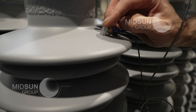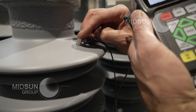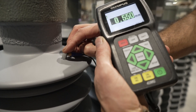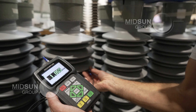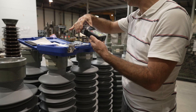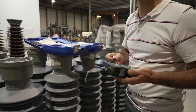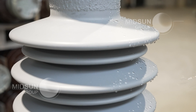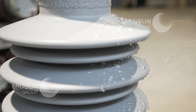For maximum protection and life expectancy, the coating should reach a thickness of 0.5 mm when dry. To measure it, you can use a wet film thickness gauge or ultrasonic thickness gauge. Finally, you can perform a hydrophobicity test by spraying water onto the insulator.